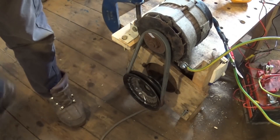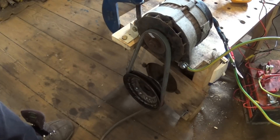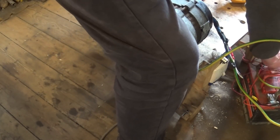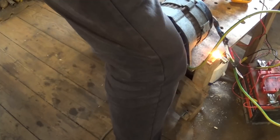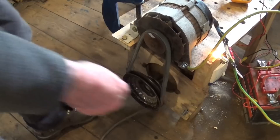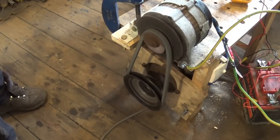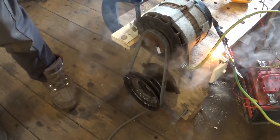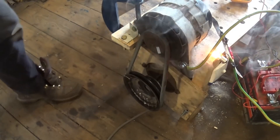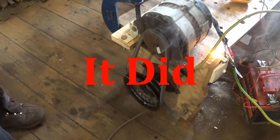As I say, I can't run it for very long on this. Put that on like that and put the volt meter on like that. Turn it on — there we are, we've got 12 volts on there. I'll turn the machine on. Oh, it doesn't like that at all — it's not going round very fast, can't leave it very long. It's charging at 13.1. There's smoke coming off the motor as you can see. Anyway, it's turning it about the same. It won't hurt the motor — it's only on for a second or two. No, it didn't like that, did it.